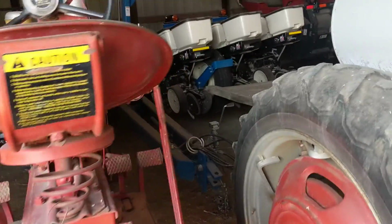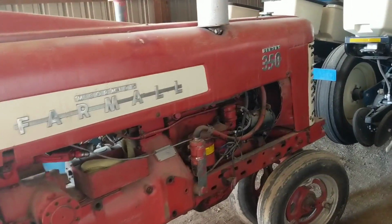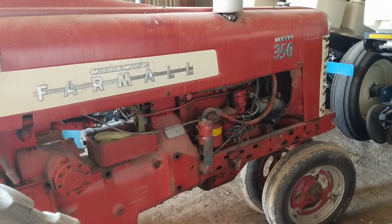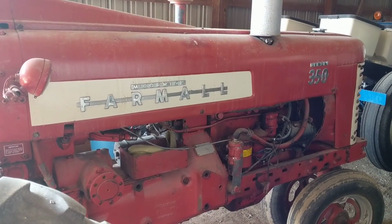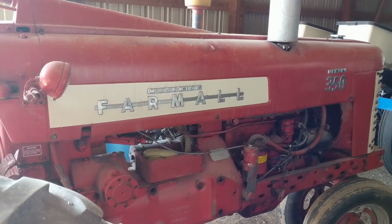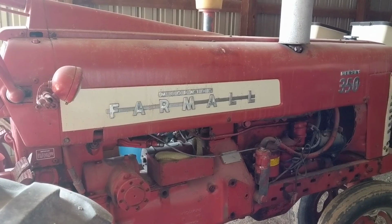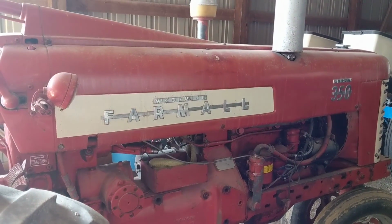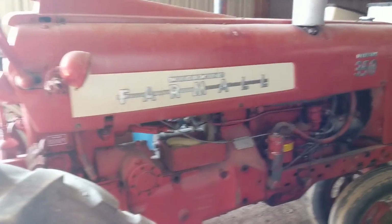This tractor here, when it was last time it was rebuilt, there was really no engine reman kits available for them at that point in time in the late 1980s, but now you can actually buy a Mahle Clevite kit for one of these. You'd have to specify your bore size and bearings and whatnot, but they actually do make a rebuild kit for this engine now.